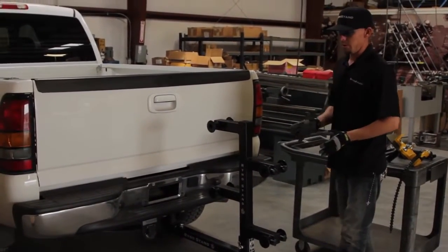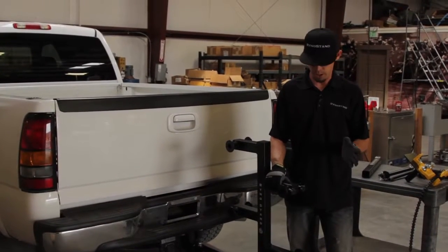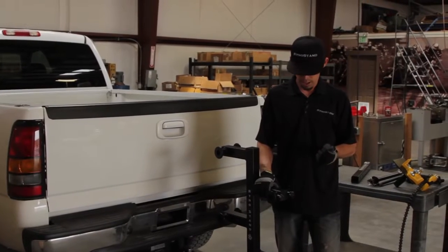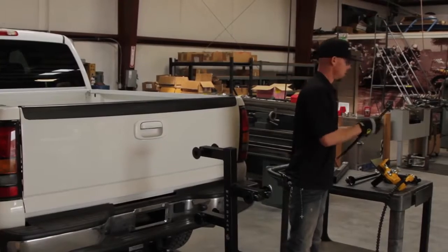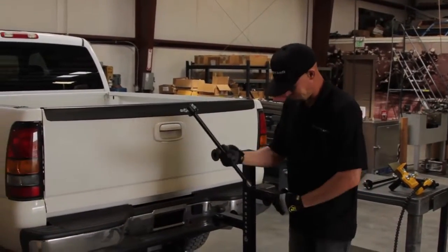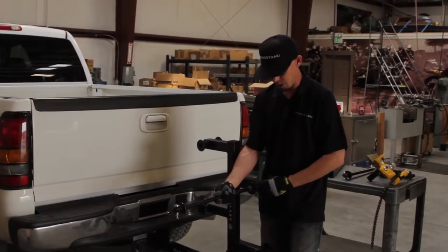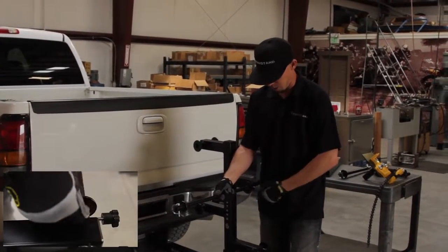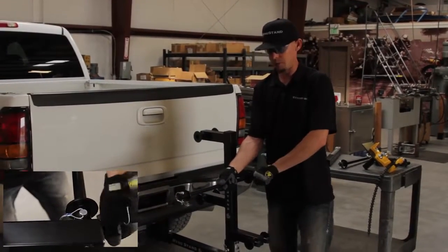And then from this point you've got a choice of two different rod sizes to hold your wiring. Whether you're going to be using the 500-foot rolls or you're going to be using the larger rolls, we've made two sizes to accommodate whatever you'll need on the job site. So using these, it's a pretty straightforward design. You're going to back out this 1/4-inch knob screw. Insert the rod into the post, and then tighten the knob screw back up.